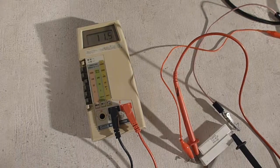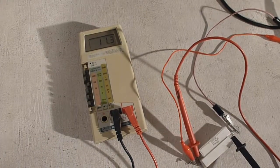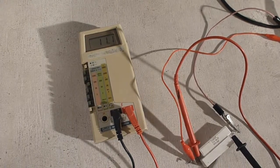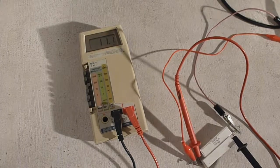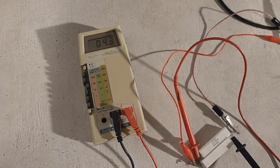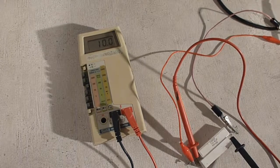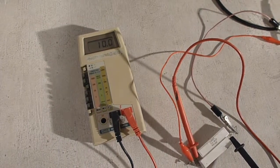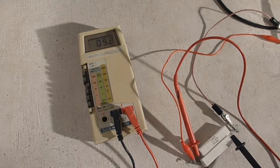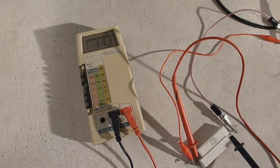That's true of most amps. Say you have an amp rated for 50 watts — it might actually be putting out a little more when turned all the way up, because it's rated at the point where it starts to go into hard clipping. This is the same measurement most people use. Another interesting thing: if you try different tones, you might get different results. For example, turning the bass knob all the way down causes the power to really drop off, whereas dropping the treble at 300 hertz doesn't lose much. At 3000 hertz you'd likely see the opposite. So you may want to try a couple of different frequencies and see how much power your amp produces at various points.